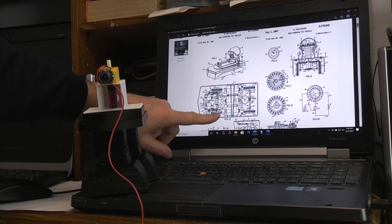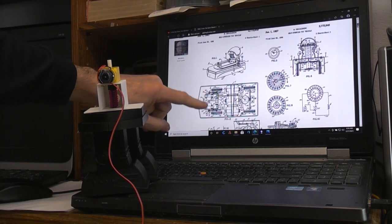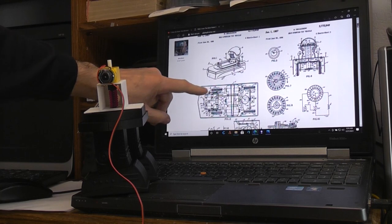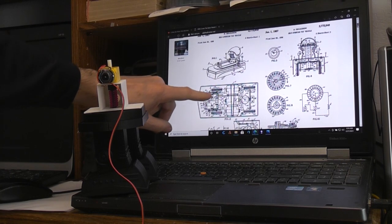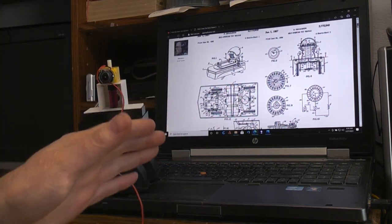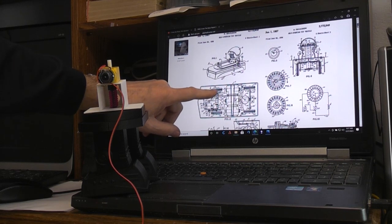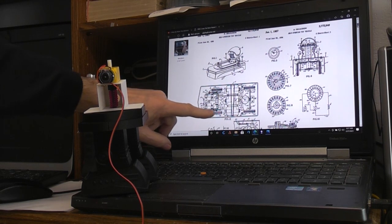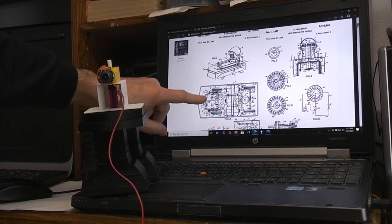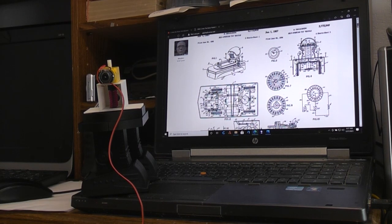Well, let's just say if this motor was on, it would kick the whole front end to the left. So the car would be moving and turning to the left. But if this wheel, which is connected to this motor, was locked to that motor, it would be off. That would work like a stop. The car wouldn't be able to move. It would just bind up. It couldn't go anywhere. So this has to be able to freewheel when something else is pushing it forward, but it has to be able to grab when that motor's running. And what they used in there is a spiral spring clutch.